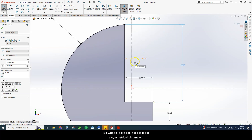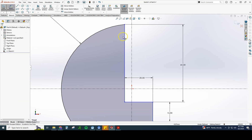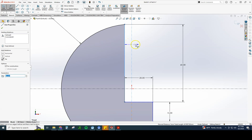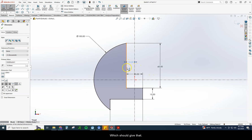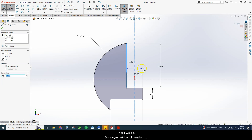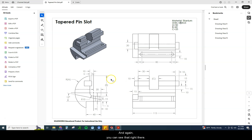This 10 right here looks a little off — it did a symmetrical dimension. So I'm going to select this and go from here to here. This is a good learning point: if you have your mouse to the right of the centerline, it's going to make it 10 on each side of the centerline. What we actually wanted was 10 in between the centerline and that line — so we actually wanted this 10. A symmetrical dimension would have been 20 on that. That vertical line is 10. The 5 is going to be that little notch we're going to put in later.